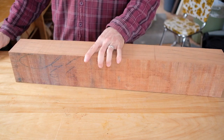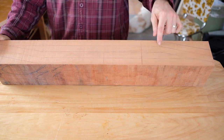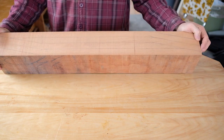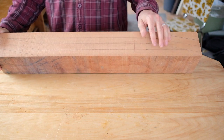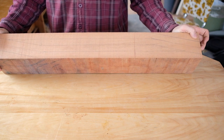Planks like this will sit in my workshop for a couple of years. It's nice to actually cut them out into their neck blanks and then leave them for a while beforehand, so that you have stable necks to work with — not something that's going to change on you.